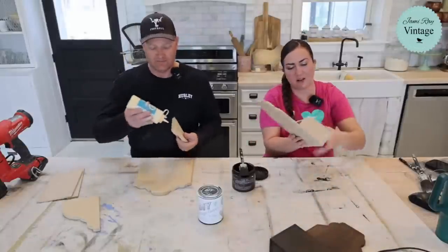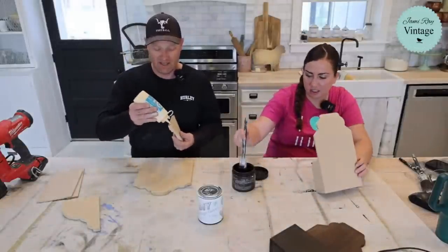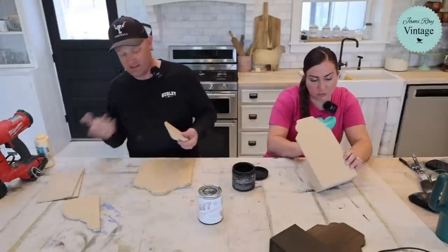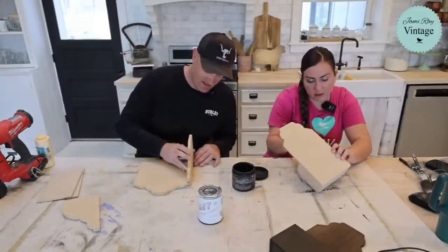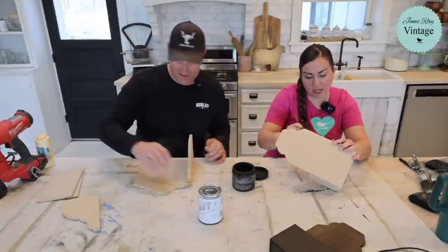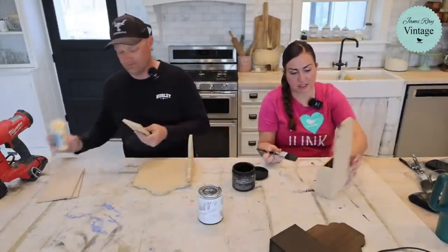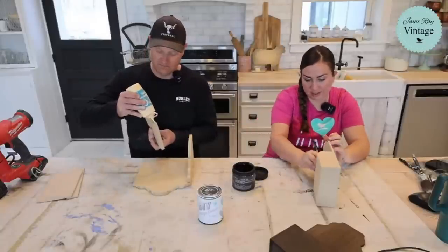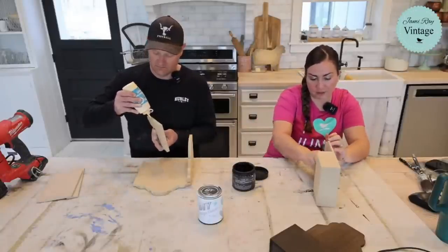Cooper took a bunch of EmTech stuff and that's already done — he took early morning classes. You really don't want to paint your pieces ahead of time because, like Zeb said, the MDF will bond best to itself. So if you want the best, tightest bond, you don't want paint to interfere with that — paint afterwards.